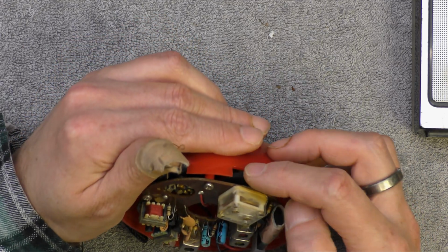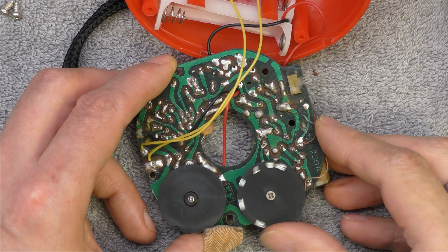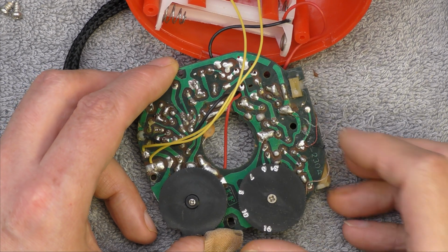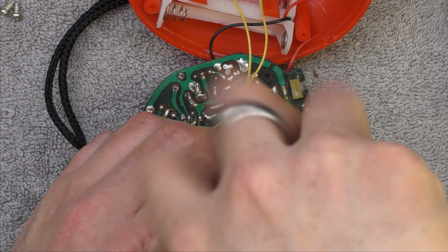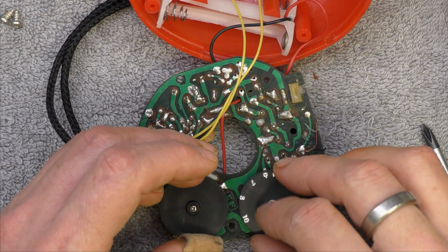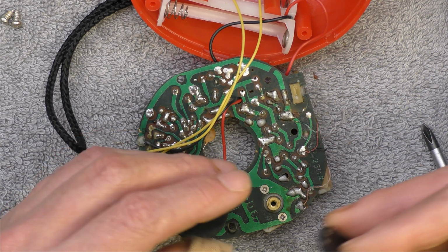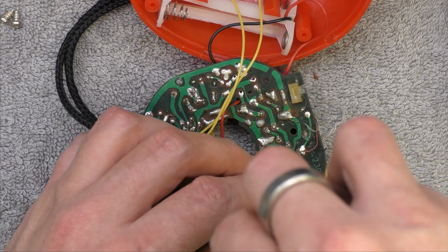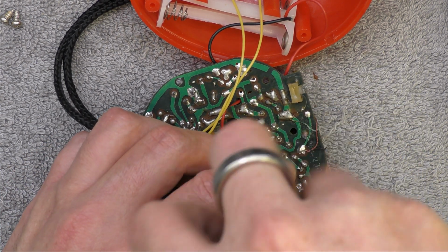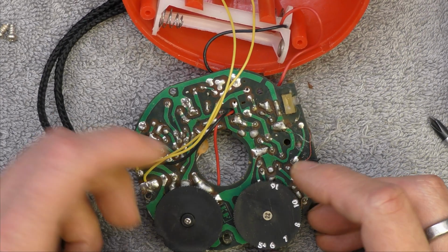So I wonder if someone has stuck this on 180 degrees out. Yeah, that's what it looks like, doesn't it? See, it's a tapped ferrite rod. So low impedance tap. So I guess this has got a notch in, I guess. Yeah, just reverse this and there we go, and I'll be able to tune it. Tomato has been fixed.